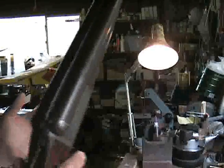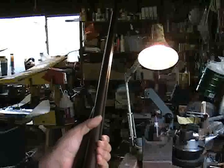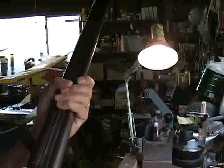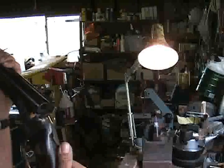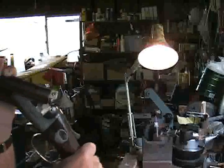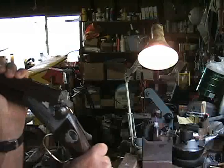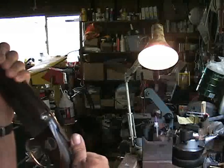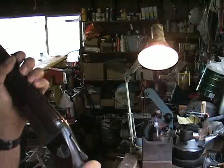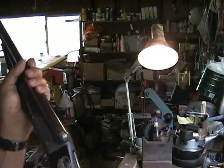The wood can be repaired with a fresh piece of walnut spliced in. The second issue is the barrels are slightly loose on the action, which is surprising given that this gun doesn't appear to have been used much, judging by the checkering and so on. The gun has the famous Greener cross bolt, which you can see here — this bolt penetrates the rib extension to give a third bite, as the English say, or a third lockup. The first and second bites are the lugs on the bottom of the barrel using the famous double under lug or double-bite bolt. This Greener cross bolt provides a third point of lockup, and these actions are renowned for their strength and durability.